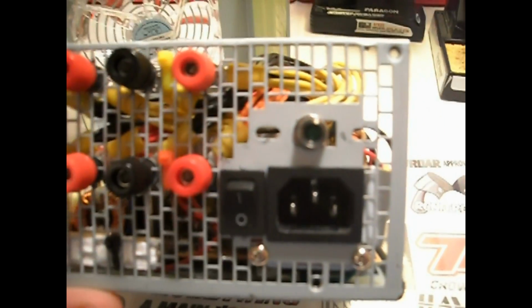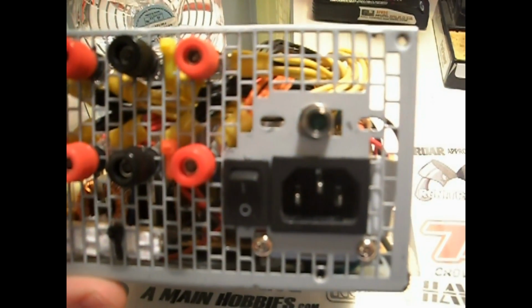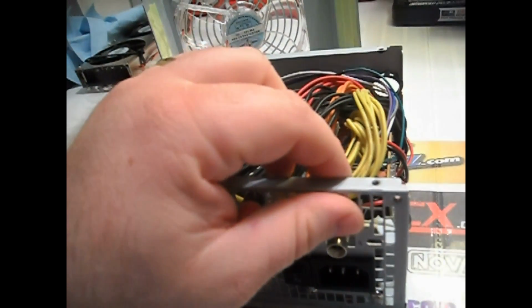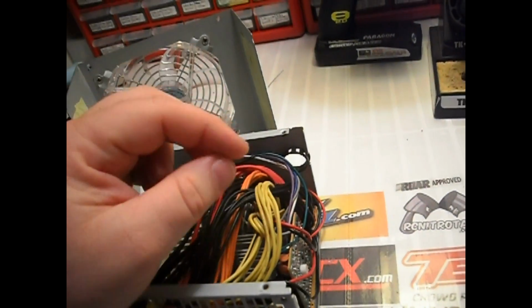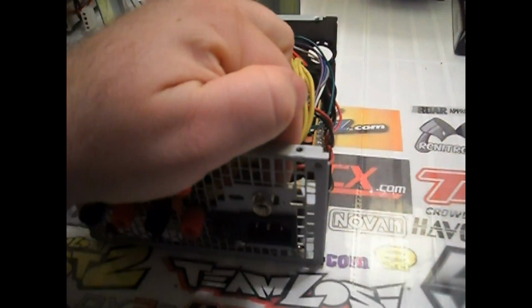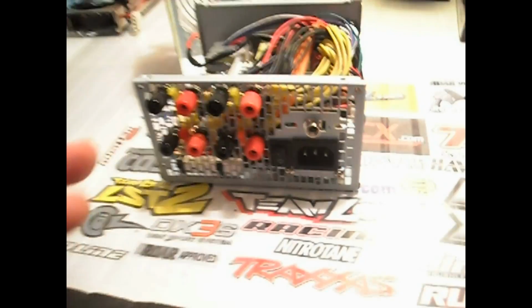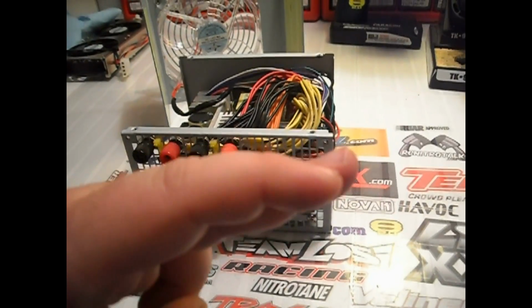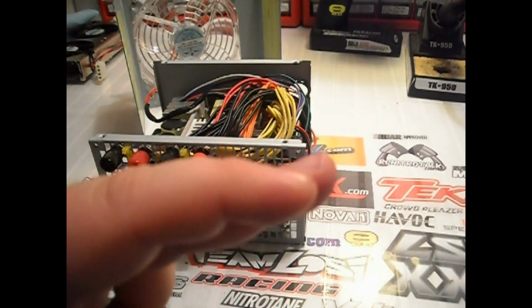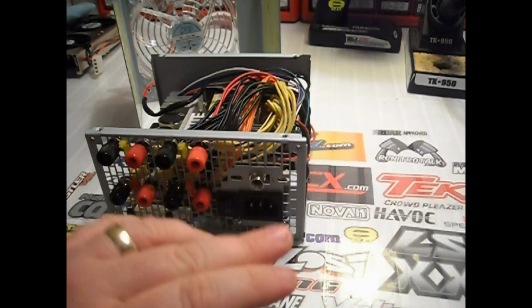If you're gonna wire up an LED, there's really only a couple things you got to know. If you've never wired up LEDs before, when you see an LED, it's the green bulb, or whatever color LED you have, with basically 2 metal prongs sticking off of it. One prong is just a little bit longer than the other one. The shorter prong is your negative, the longer one is your positive.